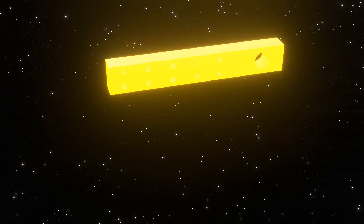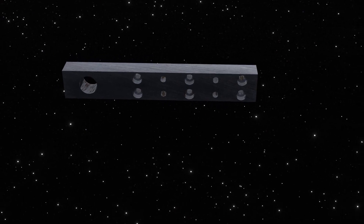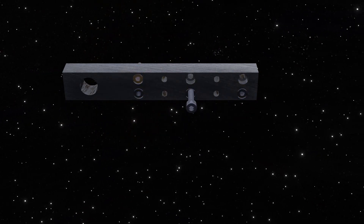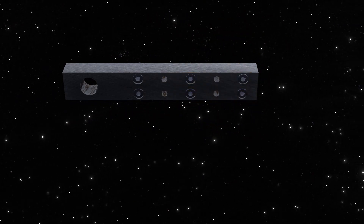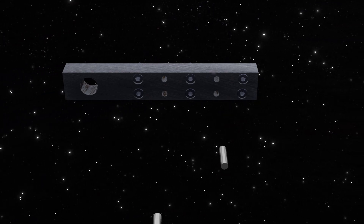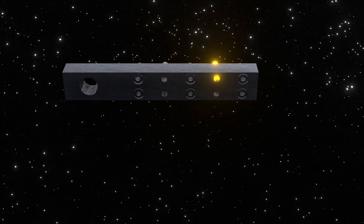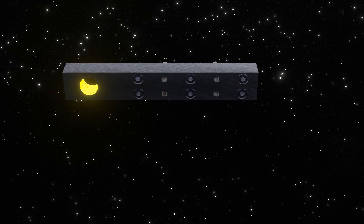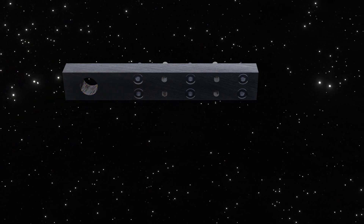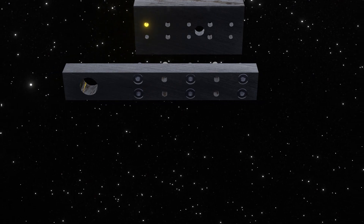This is the holder that attaches the tool to the tool holder in the lathe. It is attached to the base using six M4 cap screws. The four dowel pins locate the base and the holder together precisely. The big hole is for the eccentric cam which drives the mechanism. The base has threads for the cap screws attaching it to the holder.